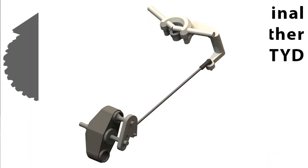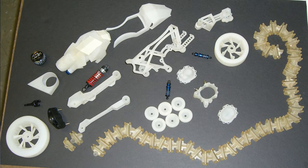Okay, so here on this page, this is how the steering mechanism is supposed to work. You've got handlebars like a normal motorbike here on the top. And then that pushes a rod down the suspension arm, and then it pushes this, I don't know what you would call that piece with the slot in it, but it'll push it forward and back, and then this little pin in the center of the upright here will slide within that slot, and so that's what causes the front wheel to steer left or right. Hopefully that makes sense.